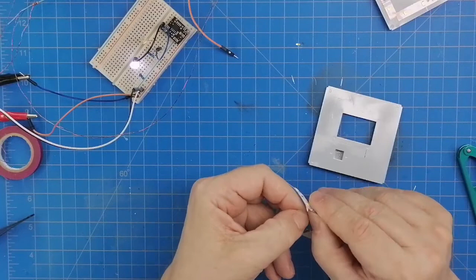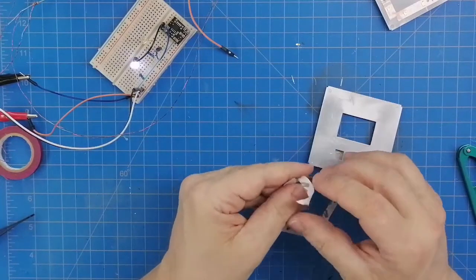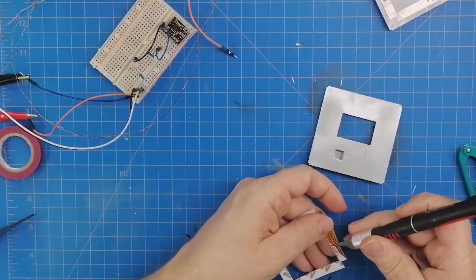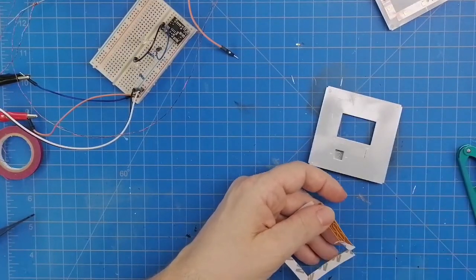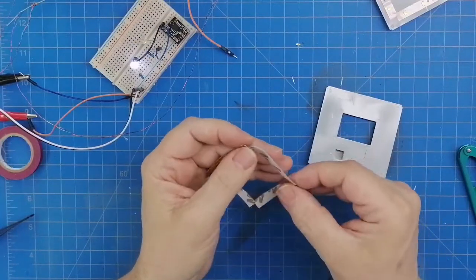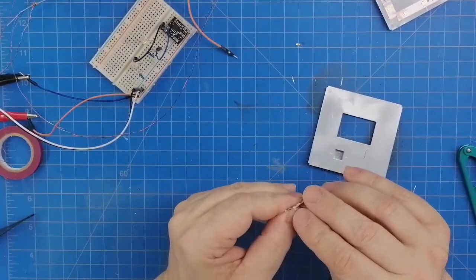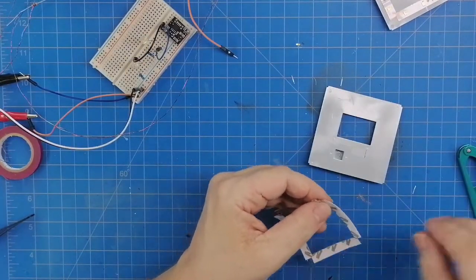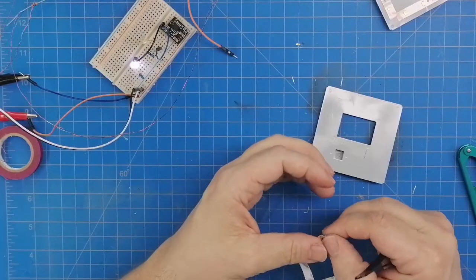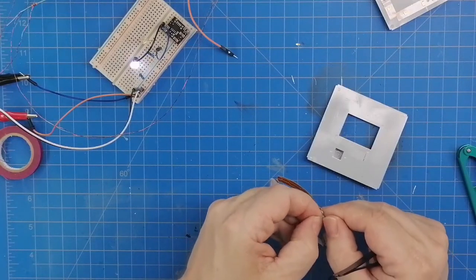And I will say, this is some cheap, I think Chinese, China is where I got it, solder tape. So it has had some funky issues, but nothing is broke yet. And that's the other thing. That's why I have this tower now sitting here running 24 hours a day. I always do that with my LEDs. I burn them in. It's suggested to burn them in for 8 to 12 hours. I tend to burn them in for 2 to 3 weeks, because if they last that long, they're going to last just about forever.